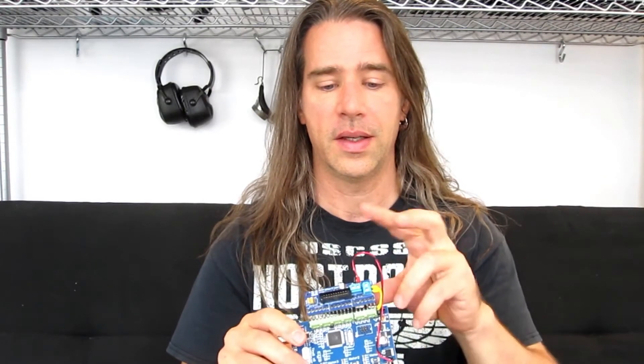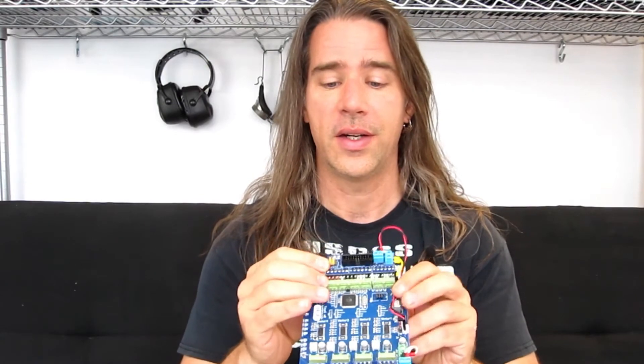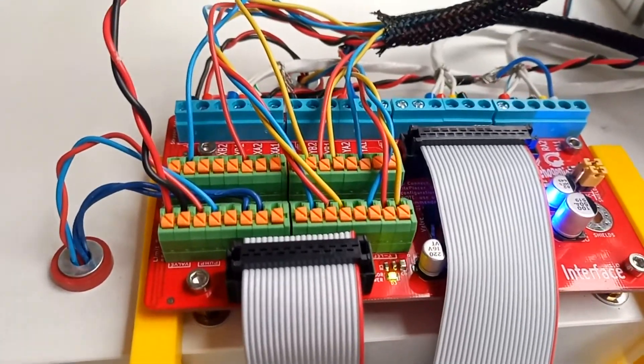On the other side you've got the sensors and control — basically the LED, the e-stop, and this little header that allows you to switch with two jumpers: you can select open pick-and-place mode or light placer mode, which is pretty cool. There's a similar jumper on the interface board to select how you're dealing with the ground from the shield — either straight to ground or USB shield style where only the AC comes through. All the instructions will be available on the page where you found this or the link below. I hope it's as useful to you as it is to me — let me know how it goes and enjoy your pick and place!